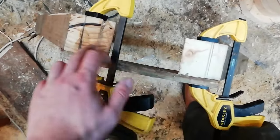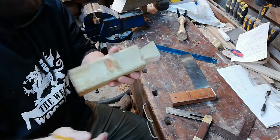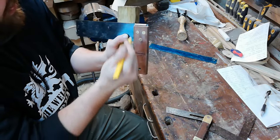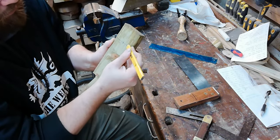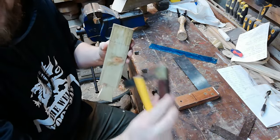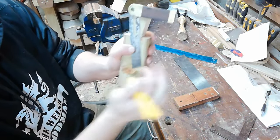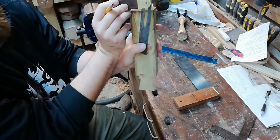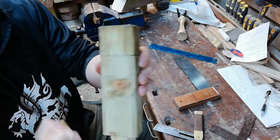Since we've got the cross beam sorted, we're going to work on the top dovetail to connect the top two pieces. I'm going to show you how to lay out and cut a dovetail like this. The first step — I've measured in two inches from the end and I'm going to use a tri-square to score a line across, making sure the square is nice and flat against that edge. I gauge the centre of that line and measure 12 millimetres either side. Using a really handy tool called a bevel gauge, which gives you your dovetail angles, I line that up with the 12 millimetre mark, and we've got our dovetail laid out. We're going to cut away these sections on the bandsaw.